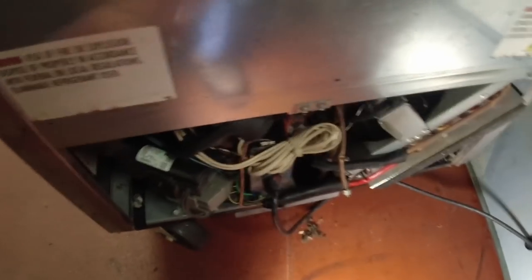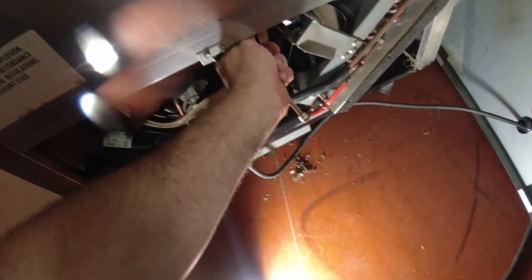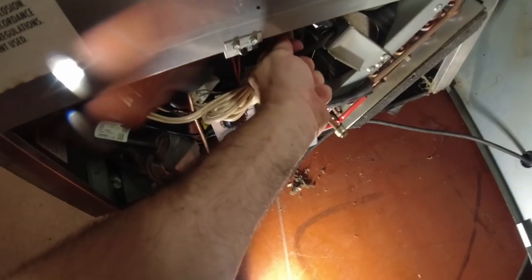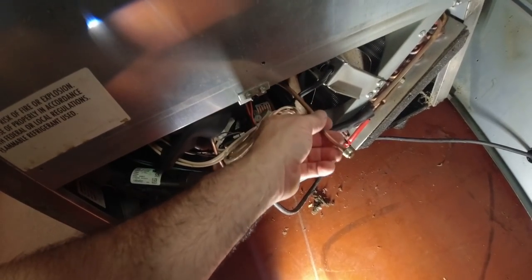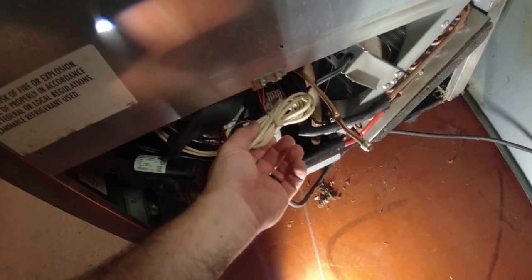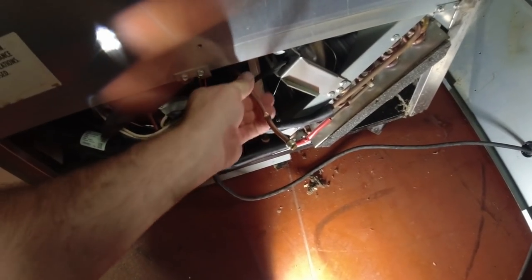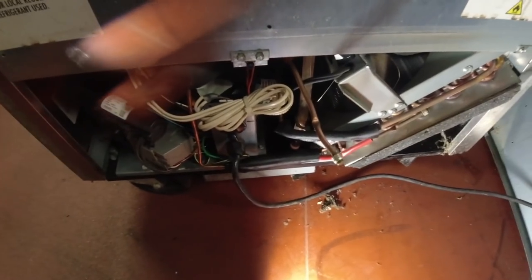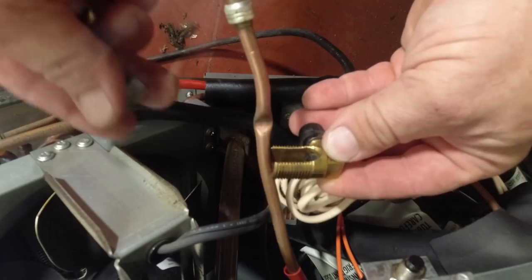We're not in a deep vacuum because it's obviously freezing down, or getting cold, I should say. So we're just gonna tap onto that and we're done. We'll crimp it back off and seal it back up. There's still too many people that don't know about 290 that could jink around with it, cause a problem. So I'm just gonna follow the procedures that you're supposed to. So a quick puncture thing, we'll take this back off and we're done.